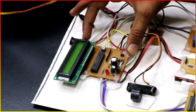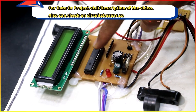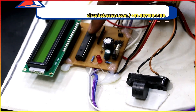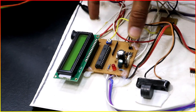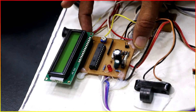First of all, let me tell you the components. This is the microcontroller board which is using an ATmega328 microcontroller. Basically, we have taken this out from the Arduino board and placed it on a PCB. This PCB we have made by ourselves so that we can place the LCD, potentiometer, and all these things — all these connections are very easy on this PCB but can create problems on the Arduino board. That's why we have made this PCB.